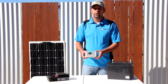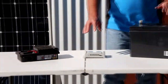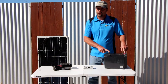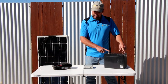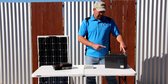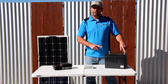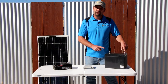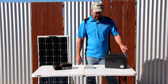First of all, I'll cover the pulse width charge controller. What this does is essentially, if the battery is drained, you run the panel through this and when it's drained it makes a connection — basically directly connects the battery up to the solar panels — and it'll charge until the battery starts getting full. Once it gets full, it starts the pulse width, which means it disconnects the solar panel and then connects it. As it gets fuller, it stays disconnected longer than it's connected, and eventually it just connects for a second and stays disconnected, keeping the battery full and controlling its charge.